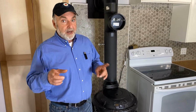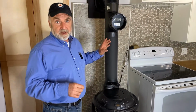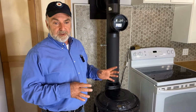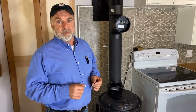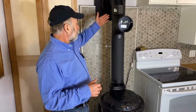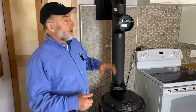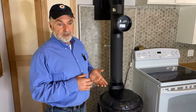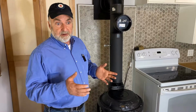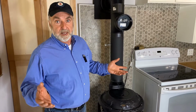And that does not include a very big difference, and that's the whole chimney thing. If you've got an airtight wood stove, you should be cleaning that thing multiple times each winter. And that means taking the stovepipe off, taking it outside, brushing it out, and then going and cleaning your chimney too. It's not unreasonable if you're heating in a serious way in a cold climate to have to do that every 2 weeks. Certainly you wouldn't want to let it go for more than a month.